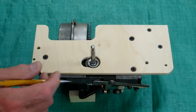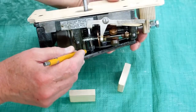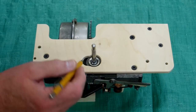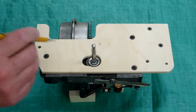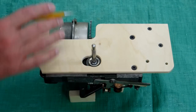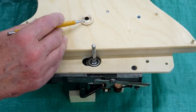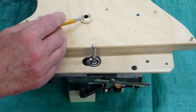When the motor is mounted in the phonograph, the turntable sits on the spindle. The weight of the turntable is transferred directly to the end of the shaft, which is cupped out and rides on a single steel ball. There's a hole drilled in this casting — that shaft passing through there is really more for stability, not so much a bearing, even though it did have a felt around here to keep it oiled. When I run this in a horizontal position, I didn't really think that was a good support for that shaft. I installed a five-sixteenths oil-lite bushing for the shaft to run in on this side of the head, and I intend to have the same thing on the other side as well.